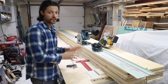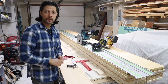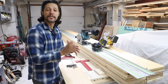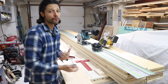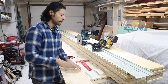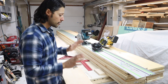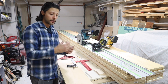Behind me on the bench I have a few tools set up that are precision for this type of work. If you're just working on a construction site using general lumber like two-by-fours to frame walls, they need to be straight but not that straight — crown out and things like that help keep walls straight. When you're doing rough framing, you don't have to worry as much. But when doing precision carpentry — we're doing barn beams, which is why I'm filming this video — it's important to use the long reference edge to get all your pieces square and completely parallel with one another.